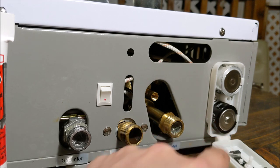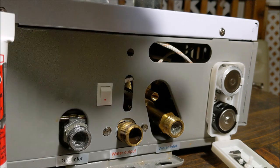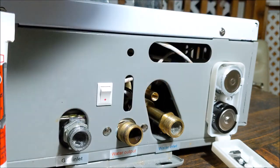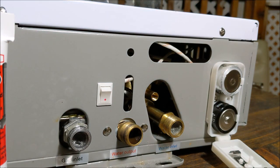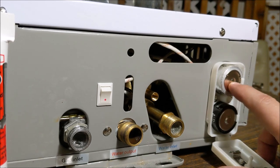You'll also notice there are two D batteries, and that's because this tank is 100% non-dependent on your house electrical current — it just uses two D-size batteries. Make sure on the labeling that you have them in the right way. In this particular case, and I'm sure 90% of them are like this, your positive terminal is on the back battery and your negative terminal is on the battery closest to you.